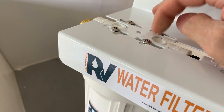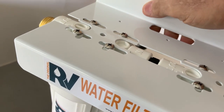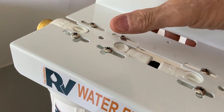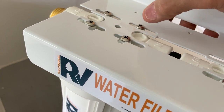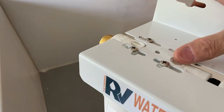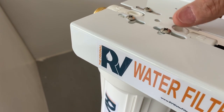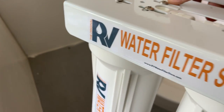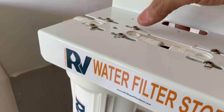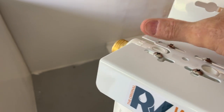But these other filter housings do not have the button on top to vent out air — the little bleeder valve. I find it very important to NOT have that on my bus, because I don't want to run the risk of something hitting that button back in my storage area. This pump would just empty the whole tank until the leak is discovered. I don't believe I have the need to purge air at these filters anyway — it'll just purge itself out the outlet.